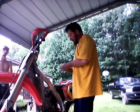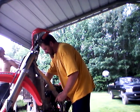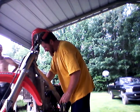Okay. Now the exhaust is off on this thing too. It's supposed to be 11 thousandths plus or minus 1, and I'm going to go ahead and do plus. So we'll do it on a 12. Here's a 12. Yeah. And it was both of them. One side was more than 12, but this may have tightened it up this time or something. I don't know. It could have. May have loosened it up. Here's a 12. 12 fits tightly. Does it? Yeah, so I couldn't hardly get it. I don't think I can get a 12 under this side. Oh yeah, I did. But it's tight, so the exhaust side's good.